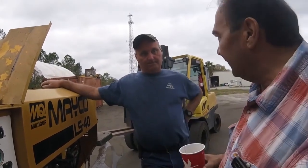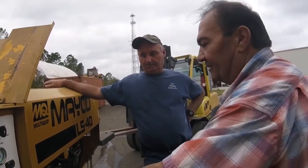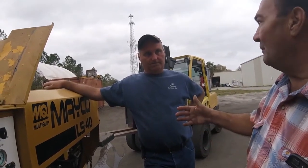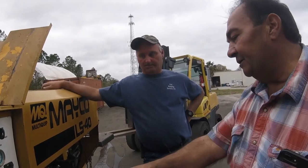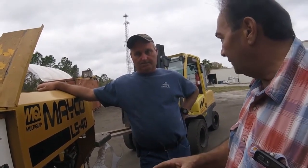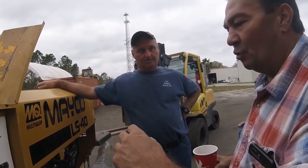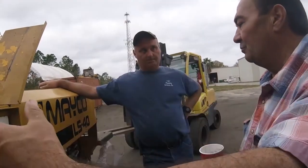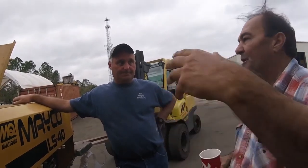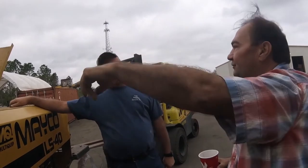What's going to matter to me is that I understand these gauges here and this here with what you just described to me. It basically is what I call my stroke. And this right here is going to determine how I want to adjust that stroke. To get more, I don't know if the word's volume, but strokes per minute. Yes. Which means I'm pumping more. That's right.